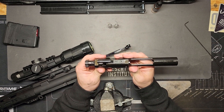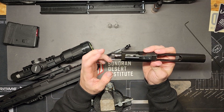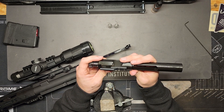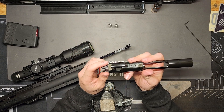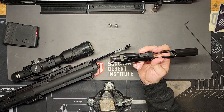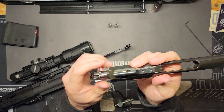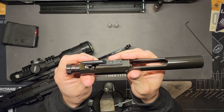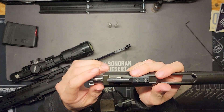The bolt carrier group is kind of the heart of the gun — a lot happens here. Many steps of the cycle of operations can malfunction if something is wrong with the bolt carrier group as a whole. One of the big things when designing a semi-automatic firearm is incorporating a delay so the firearm can fire properly without prematurely extracting or breaking open the breech from the chamber. On the AR platform — AR-10s, AR-15s, and I believe the AR-9 as well — there are mechanisms in the bolt carrier group that prevent a round from being fired before the gun is locked with the round in the chamber.